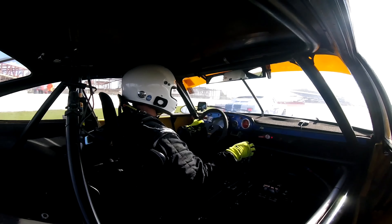Eagle-eyed viewers might have noticed from one of the team's recent videos that the carbon fiber headlights were a success. As you can see, the Camaro is slowly taking shape. The whole body's been sanded down — it's still not perfect, there's a lot of areas that need a lot of work still. I've been using filler where I can, not too much obviously. The front wings I've been working on in situ, but I have just taken them off. It's all about just getting a good surface so we can make some molds, then create some carbon panels.